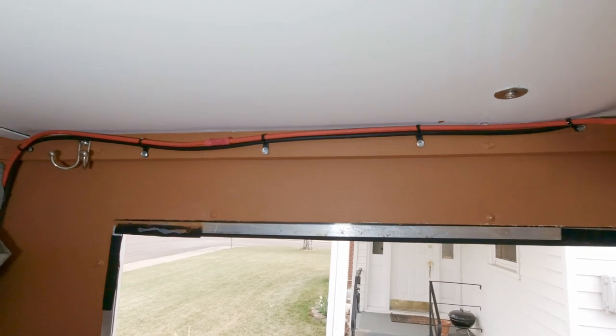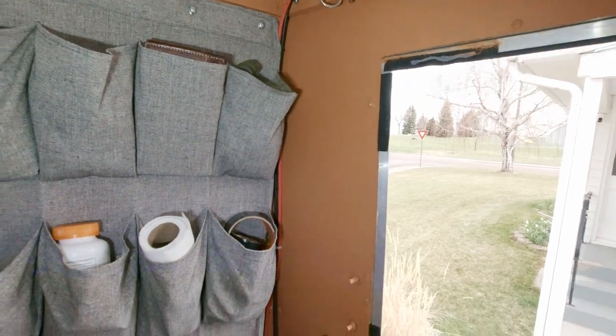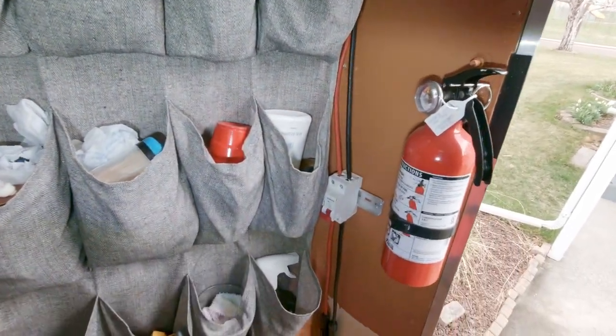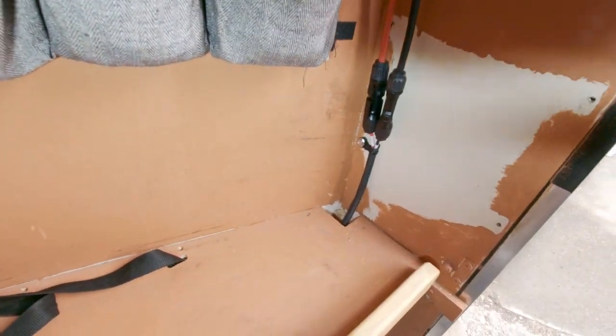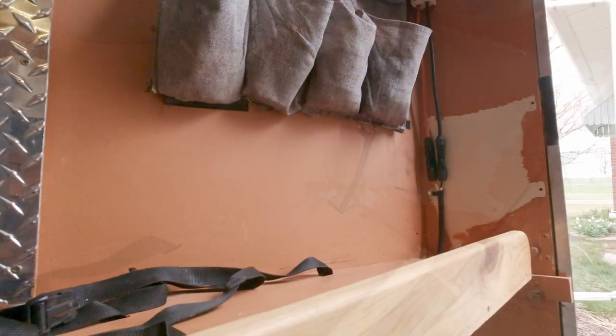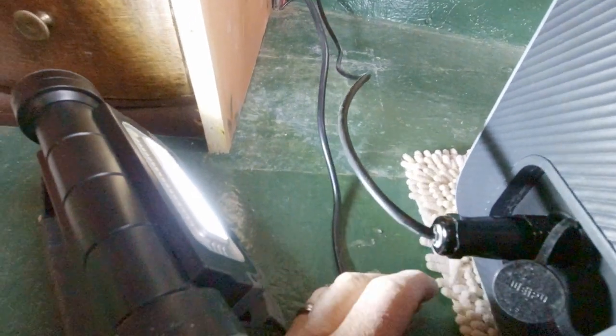Well, it's done. Although done isn't the right word because nothing's ever done in this trailer. I'm sure I'll be ripping that out of here in the future and doing something totally different. But it's done for now, and let me just summarize and show you what I did. First of all, I took out the circuit breaker that I had up there along the roof line. And then coming down here, I installed the double pole breaker right down here. From there, I went to MC4 connectors, and that's where the AC200P starts. And from there, it just came down and the wire comes around and just goes into the inlet down here